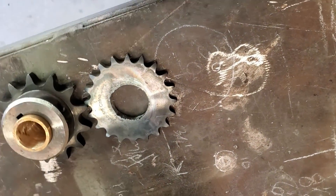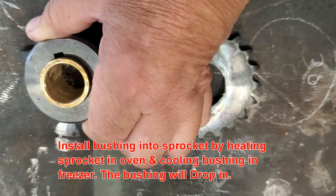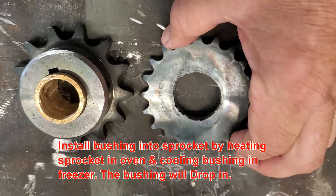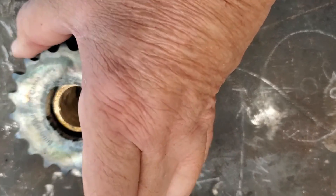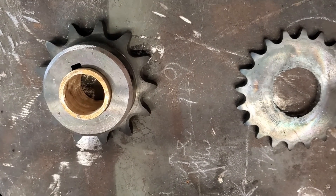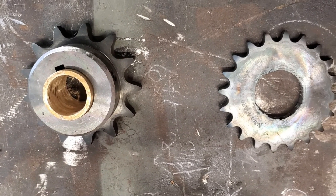On this one, using the winch, I've got to speed it up. Over here on the sprocket, I built a new sprocket for the log turner chain, and this is going to go on here like so. I'll have to weld it on over here on the inside — I've already beveled this sprocket so I can make a weld all the way around. So that's what I'm going to do next.